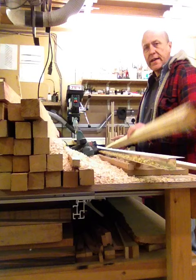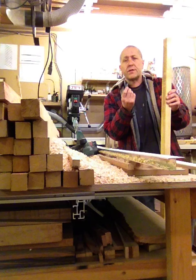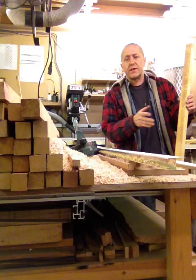I'll then take this piece of wood over to my bandsaw and quickly run it down, just following the pencil line. I'm marking it well over size — at least five, six millimetres over size — and I'll just quickly run it down on both sides.